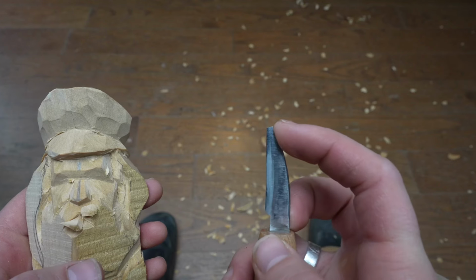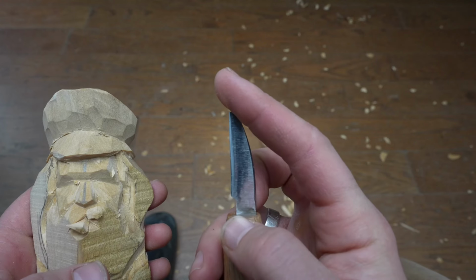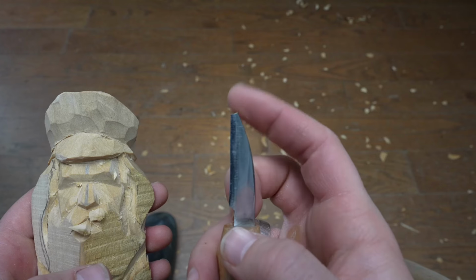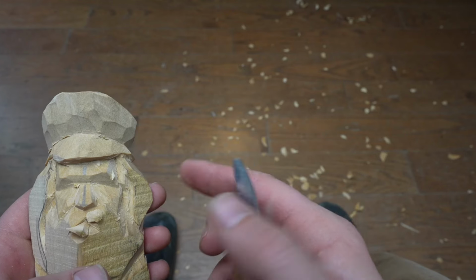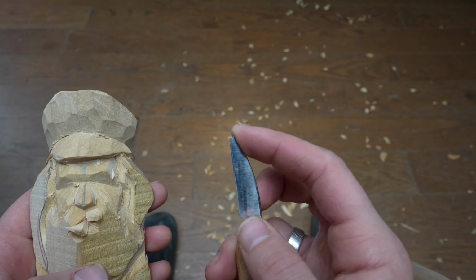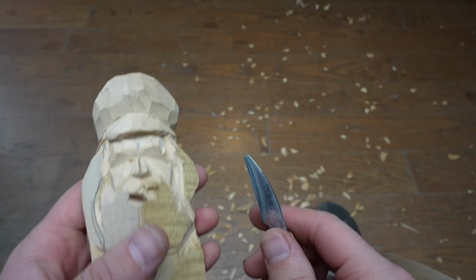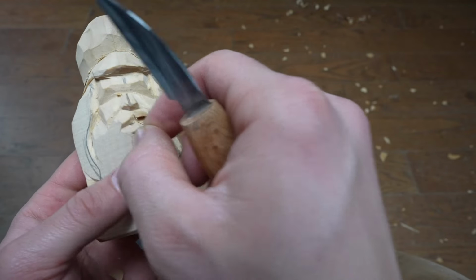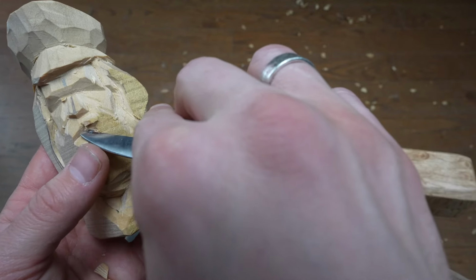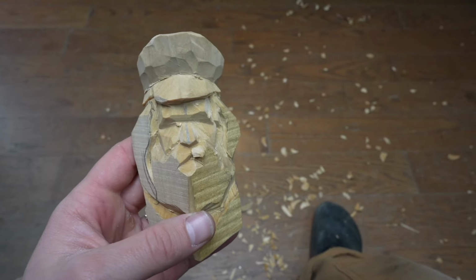And what I'm going to do is I'm going to actually sand the back to create a shorter blade just like that, right? That's the easiest route here, because I don't actually have to change anything about the sharp part of the blade. I just have to taper the back of it in such a way. But I'm going to use a different knife for now. Be careful when you're coming back into a blade. If you've chipped the blade, you want to make sure and get that little fragment, because that can dull your tool. Anyway.